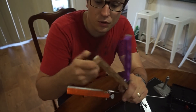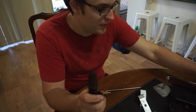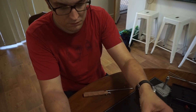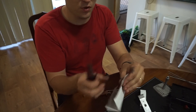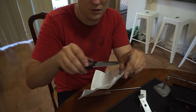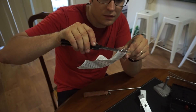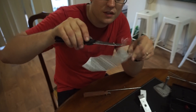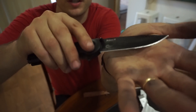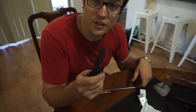Alright, so I've gone coarse, medium, fine Lansky diamond stones and stopped at the fine. It's got quite an imposing edge on it now. This poker card will do - quite an imposing edge, you can really just curl the paper. Very very nice indeed. So not as pretty, not shiny anymore, kind of tool-ish looking, but it's still 20 degrees and toothy. Let's see how that cuts.